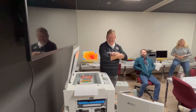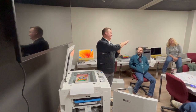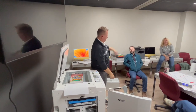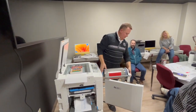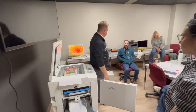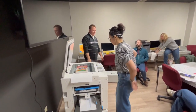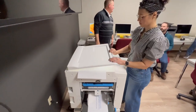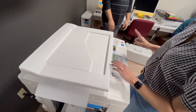This machine can handle up to about 130-pound card stock. The one caveat: if the paper has a slick coating, the ink will never fully dry — it'll roll off. The finish matters more than the weight. Softer, more absorbent papers are fantastic — uncoated stocks work best. Back in the 90s and 2000s I sold a ton of these to churches for bulletins; they used linen papers and they looked fantastic.